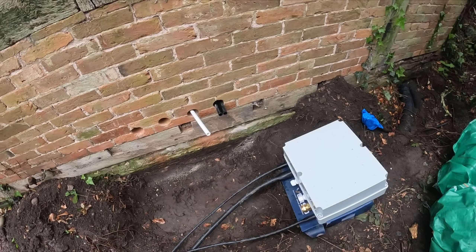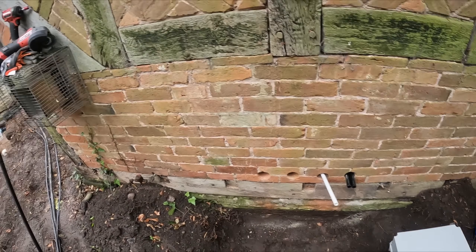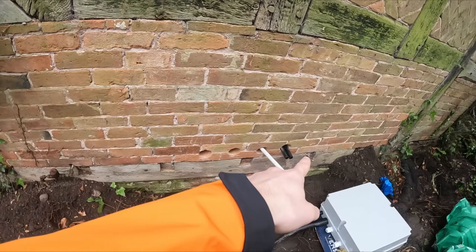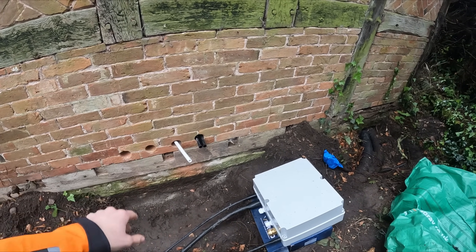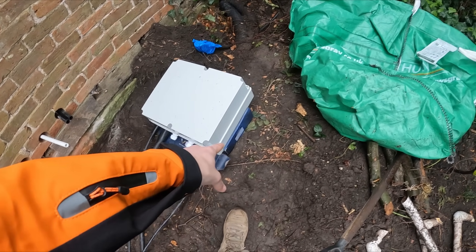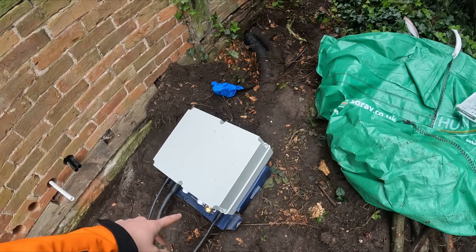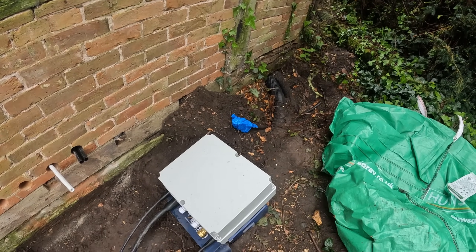Because of the run distance to the other sheds it needs to be 35mm, and ideally I'm going to run it off a 63-amp breaker to a separate fuse board down there. Overall, I managed to get one armoured in and the two smaller armoured cables over to the swimming pool equipment. The big chunky one is also in. All the rest of the glands are in and ready. I've also fabricated something: a little bushing coupler picked up this morning with some more 25mm conduit — that'll make a nice waterproof fit going through the wall.